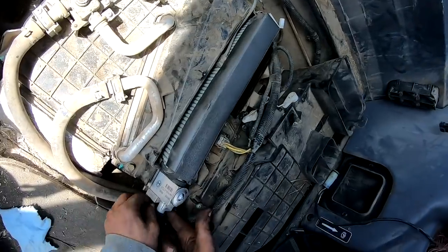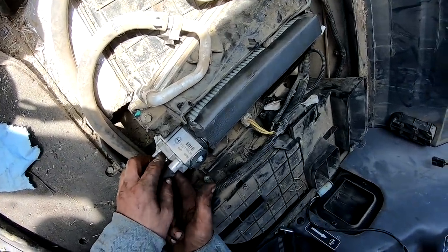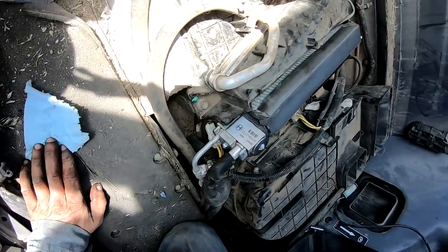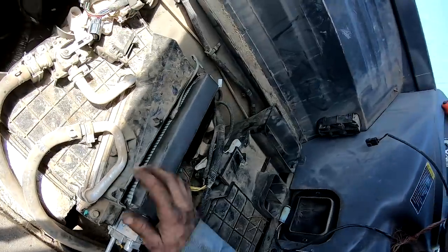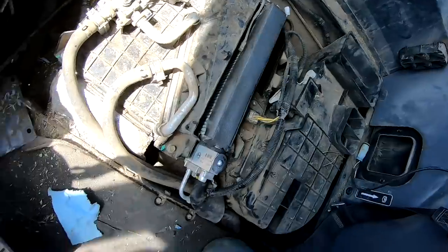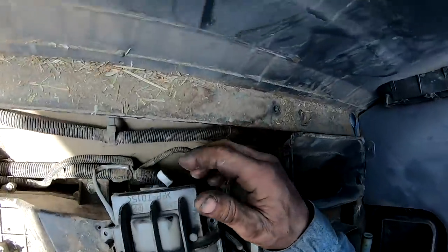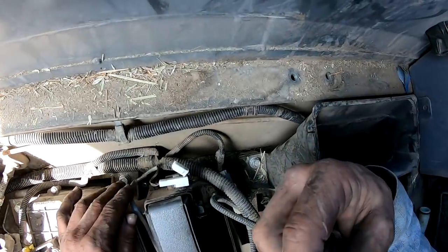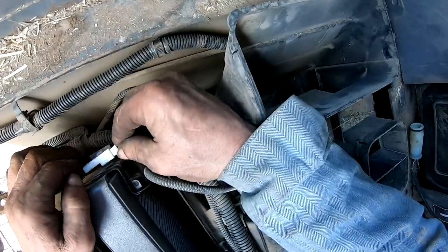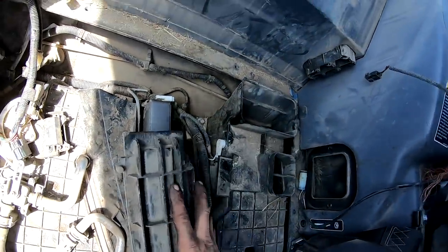And then before I completely button it up, I'm going to put a vacuum on it. I've run it off the welder. Check our vacuum. We'll have to pull a 30-minute vacuum on it. I might go ahead and stick this on there. And I got to put the receiver dryer on it, though, before I put the vacuum on it. Okay, let's plug this in. I think that's our de-icing switch. That's what that is.